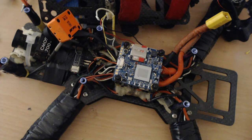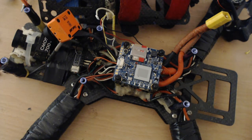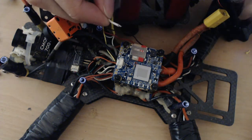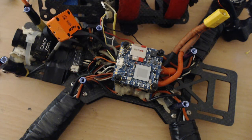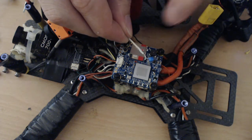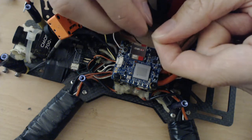The first attempt is to use one of these capacitors — they are very small, around hundreds of nanofarads if I'm not wrong. It should be placed in line from the audio output pin to the smart audio pin. So what we're going to do is solder this capacitor in line. You can see the cable from the smart audio — it doesn't matter which way you solder it, it works either way. Then we slide over a heat shrink just to keep things tidy.